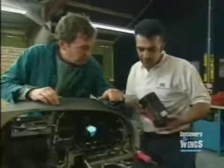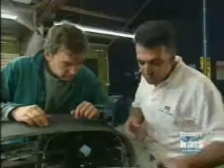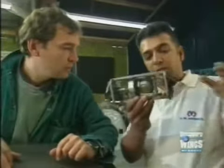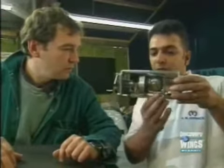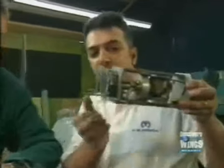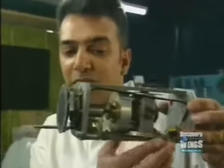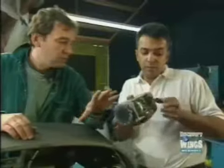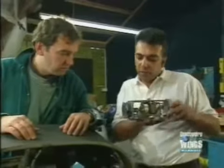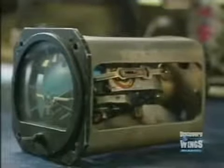Now, what's inside the DI? Well, we've got a cutout there, giving ideas. There is a gyro, which is vacuum driven. Basically, air is sucked into the instrument, which rotates that gyro. And from that, through a few gears, you get a card rotating there. So that's pretty much how the gyro works. Right. So when that's in place, the whole inside of that has the vacuum running through it? That's right, yeah. There are two vacuum-driven instruments, this and the artificial horizon, which we've got there.